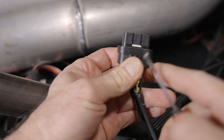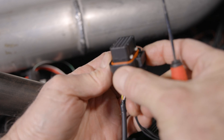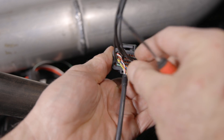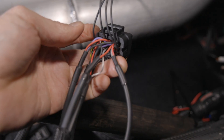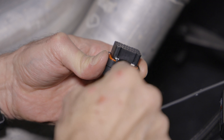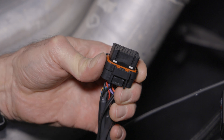To unlock the main connector, use a small screwdriver and simply push up on the small white tab on the bottom of the connector. This will unlock the pins and allow you to insert or remove them. Once you have all the pins inserted, make sure to push them through until they stop. Once all the pins are fully seated, push the white tabs on top of the connector until they sit flush, locking the pins in place.